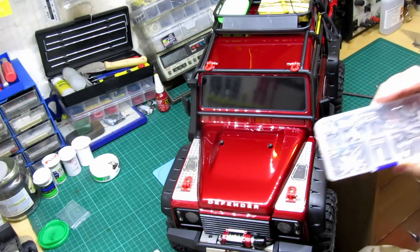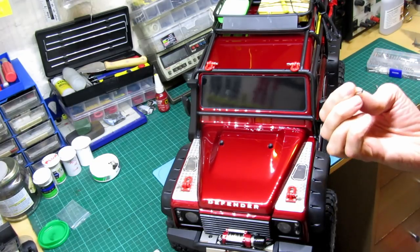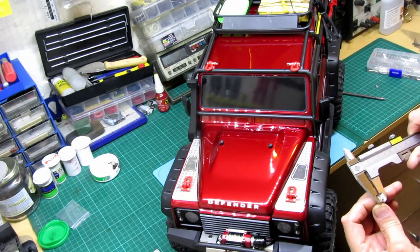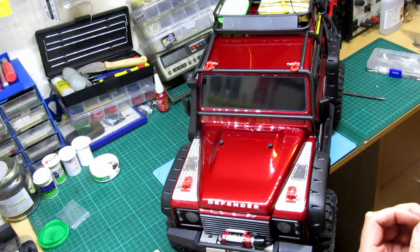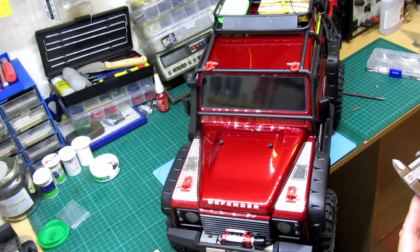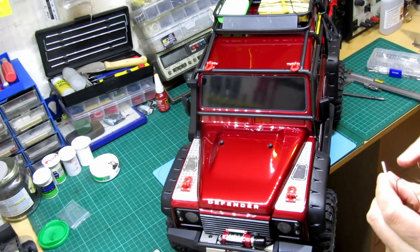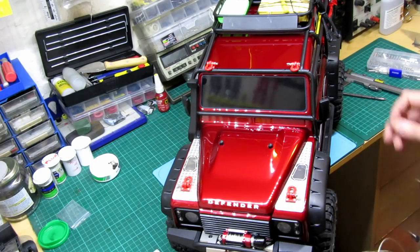I've got these things here, really for soldering cables on. But the smallest ones I've got are these ones here. The outside diameter on the smallest ones I've got is 2.5, and the internal diameter is 2 millimeters. So this cable is 1 millimeter, so there's not going to be much room. Once I pass it through there, I'll cut that in half because it looks a bit long, and then crimp it up in the vise. And it should look quite nice then. So I've got that I can use.